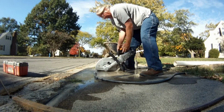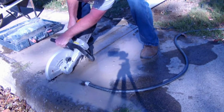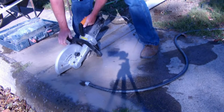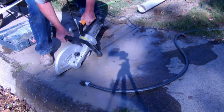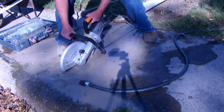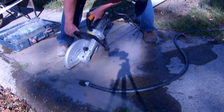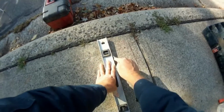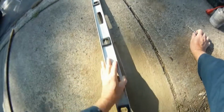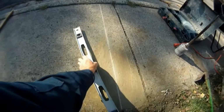Today's project, we must cut the sidewalk out by the curb versus tunneling the sidewalk. This is not your typical arrangement for a sidewalk out by the street. Normally there's an area of grass between the curb and the sidewalk. I like to make our sidewalk cuts 6 inches wide, and I always use a relief line, if available, on the sidewalk for the first cut.